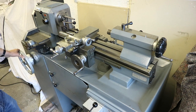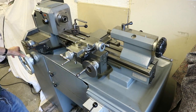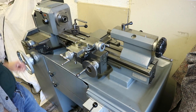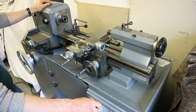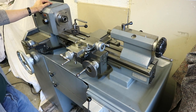Showing the clutch and brake — operating at 1,000rpm with the clutch and brake engaged, it disengages and the spindle stops cleanly. Back on again, and same in the lower speeds of course.